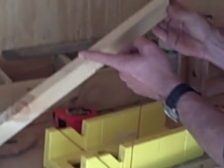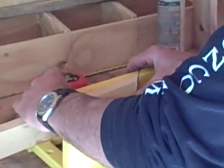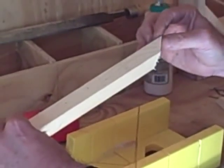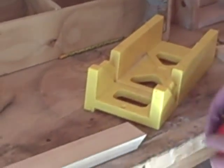The way you do the two 45s — which is what you're going to cut — is you cut one side. You just place it in your miter box, and I'll show you how to do it in a second. You'll cut it, and then from this side you'll cut it all the way towards the end. You're going to measure — remember we said we're going to measure nine inches — so I'm going to go ahead and measure nine inches, the same way you make a picture frame.